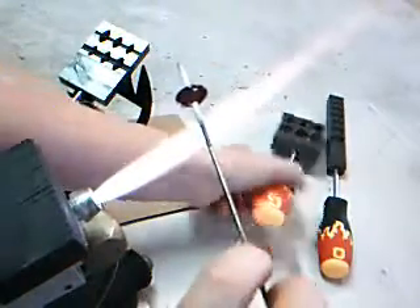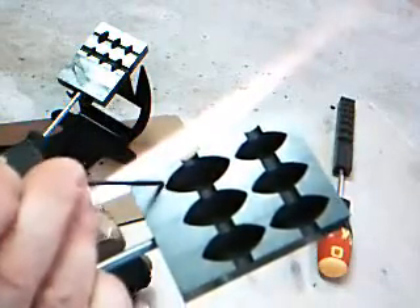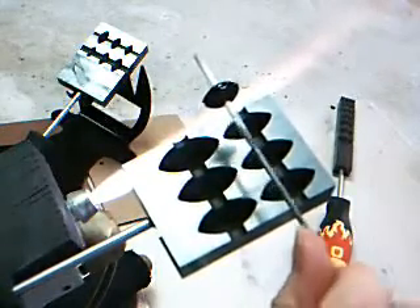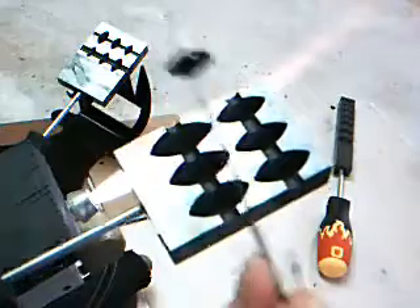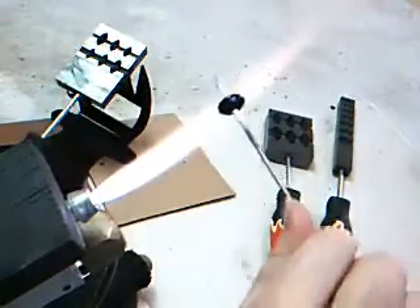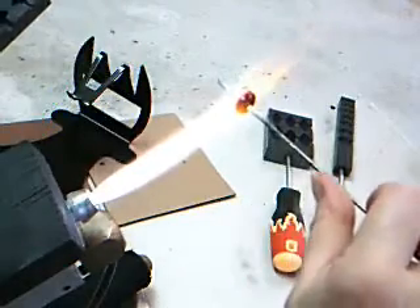With the disc bead roller, this is another version — you don't want to roll the bead down in the bottom of the cavity. You want it to touch this bottom rim here. If you're rolling it along this bottom rim, that's how you get that very distinct peak in the bead instead of on the bottom. And as always, roll lightly as if it were a flat surface. If you force it, all you do is push the glass around and it's a little bit tougher to bring it back to shape.